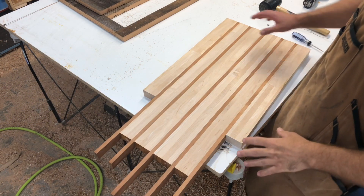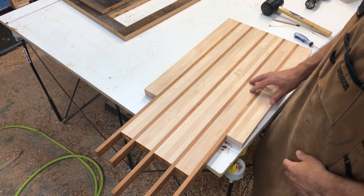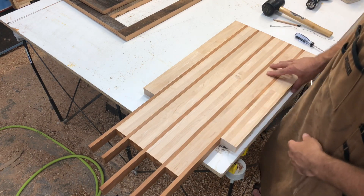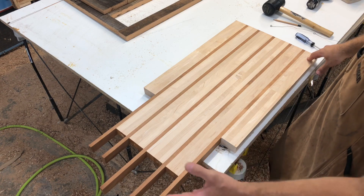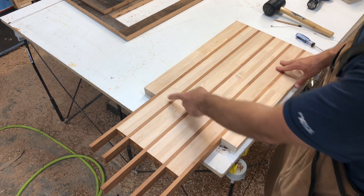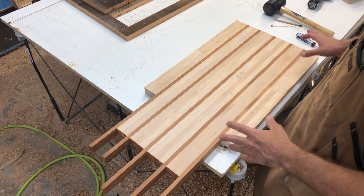This is a maple and cherry cutting board — it's a long grain cutting board. The maple came from a table base that somebody left me; I rehabbed a table for them and the base was kind of chewed up so they didn't want it, so I cut it apart and had some boards left over. The cherry had been left over from a shop project, so I thought it'd be a good use of the material. I always try and glue up things long like this — it goes through the planer a little bit better and reduces your chances of snipe. I'm trying to differentiate myself a little bit more, and that's where the idea of the oval came in.